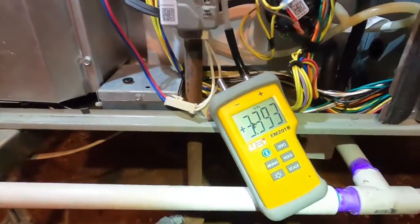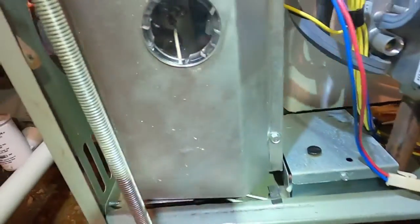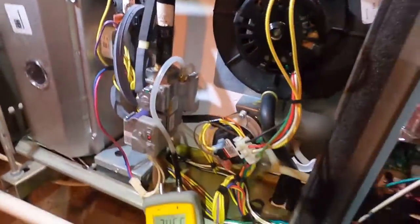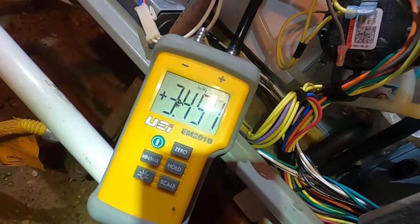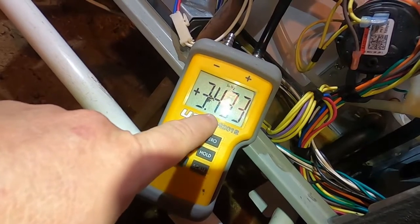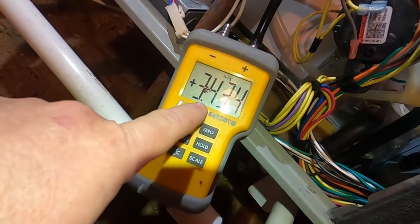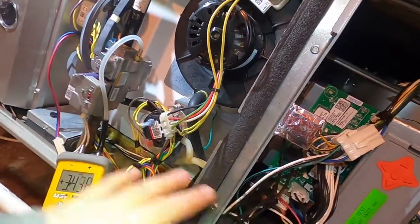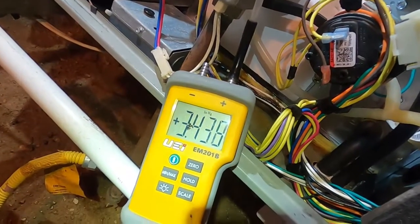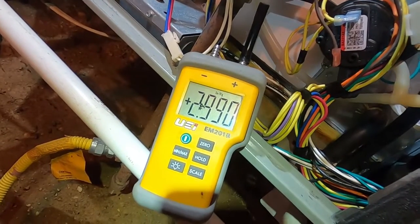The igniter is coming on — yes, it just fired off. It was reading real low initially. We're looking for 2.1 on LP. Check the burner down there. Let's see where this stabilizes out. This is the one that can cause high limit problems — if the low pressure setting is set higher than it should be, as this blower ramps up and the valve ramps up, you're burning hotter than the airflow being delivered, causing nuisance high limit trips.